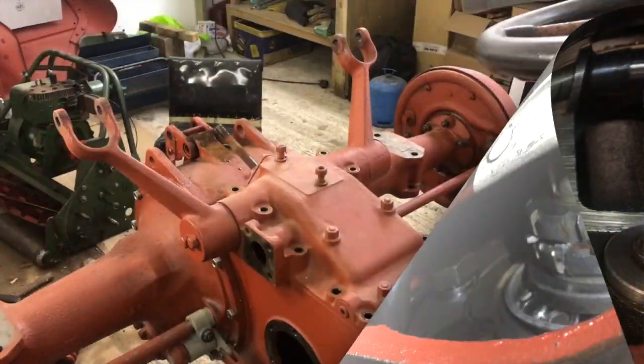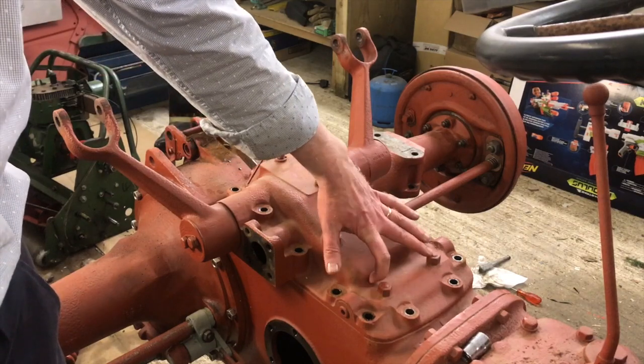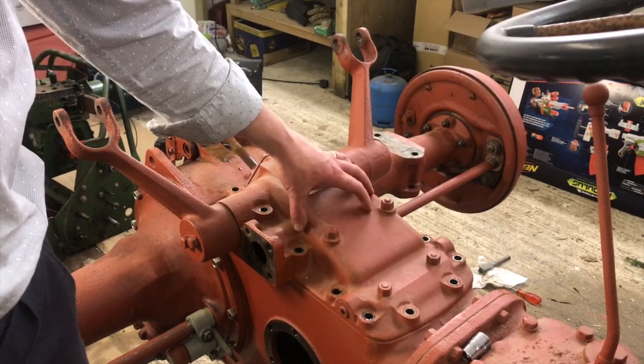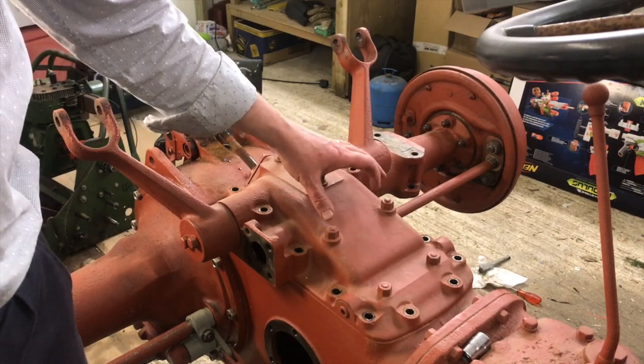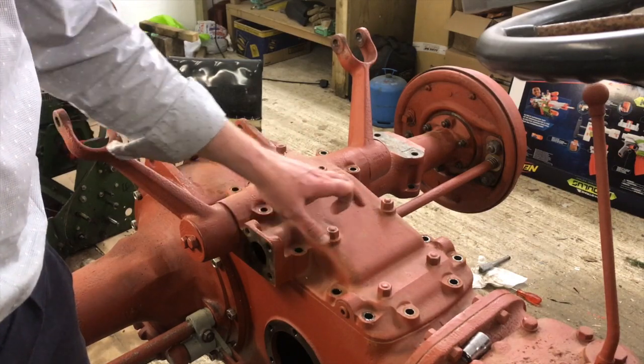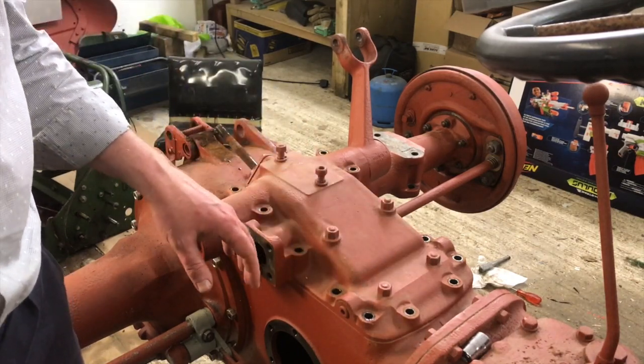We'll come back. Okay, we've taken out all the bolts except for these four. These four hold the master cylinder to this top plate, and we want to take it out with that. So we leave these four. What we might do though, before we try and lift it, is loosen those just while it's in place. It'll be easier to loosen them.